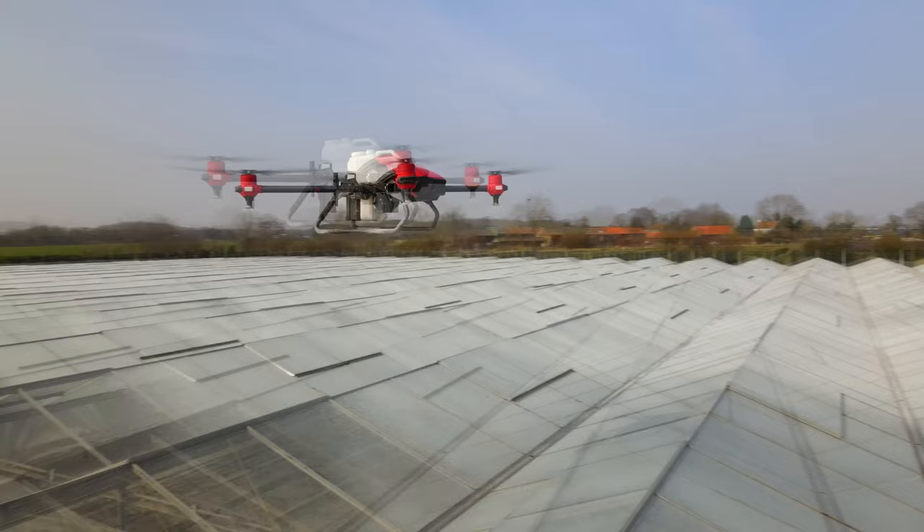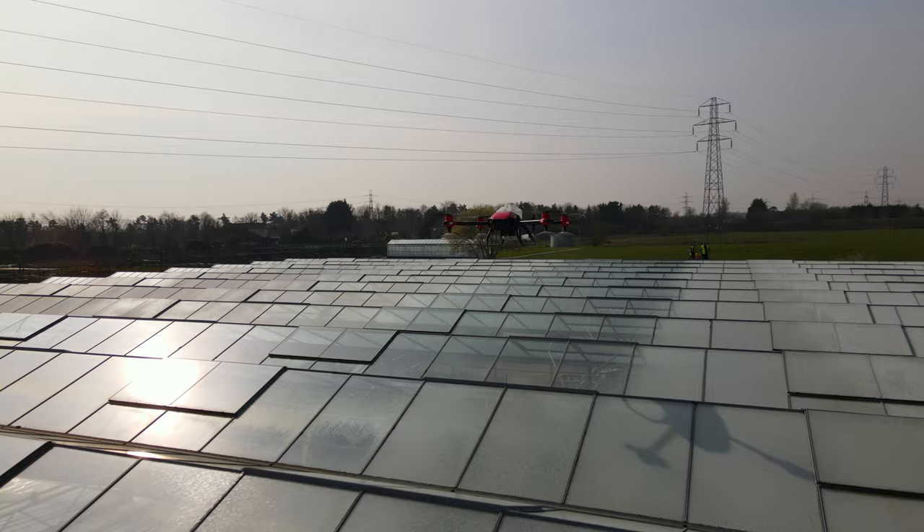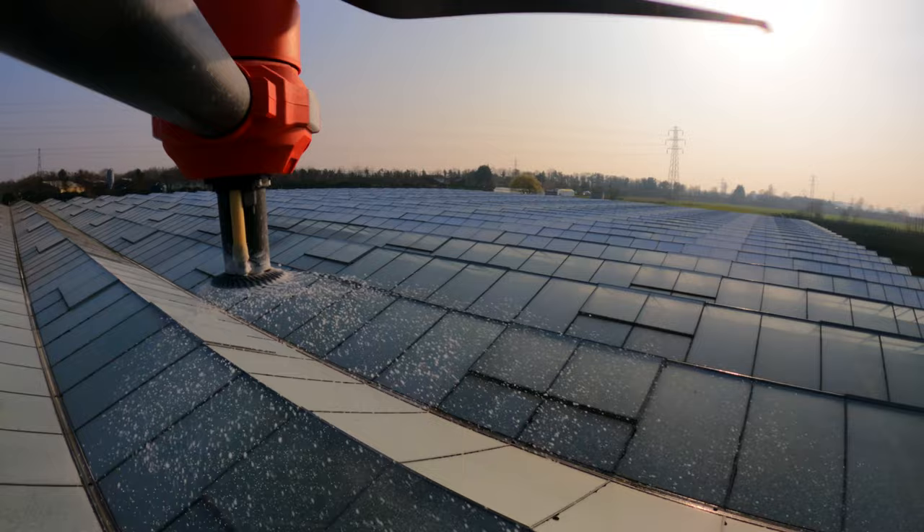As you can see from the results, the settings have been pretty well dialed in. The glass was getting well coated, which gave an ideal shading for plant growing areas. And in the main production areas where lots of staff work, we gave a second pass to give even greater shading to help keep temperatures down. This ability to layer your shading has proved to be a big advantage in optimising conditions in the growing and production areas.